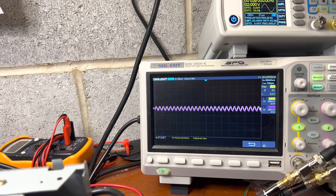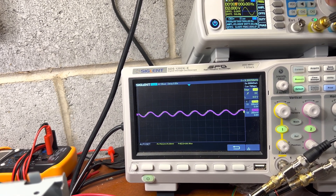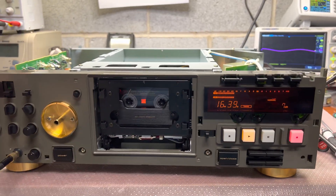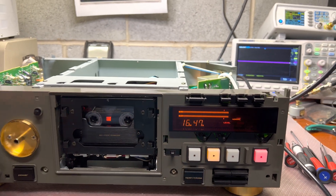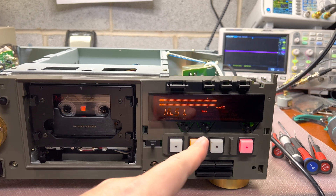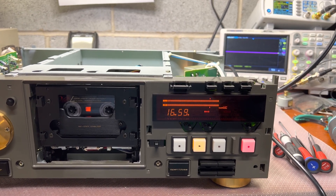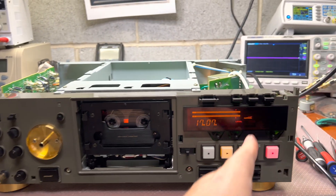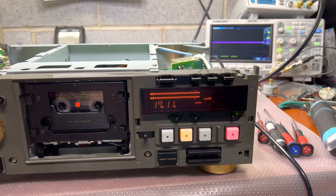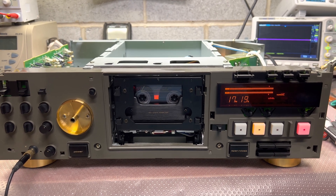And it's type one tape. Twenty one — let's start dropping. Twenty two — that's it. On all range it's very linear and bias is perfect. Now let's see how our adjustments will level — it shows a little bit off. On the level and bias it shows off — we just check it, that bias is there. So we need to adjust indicator position. But now it's in the middle and it's balanced between left and right channels. Let me check the service manual instruction on how to set those levels, and I will get back to you soon.